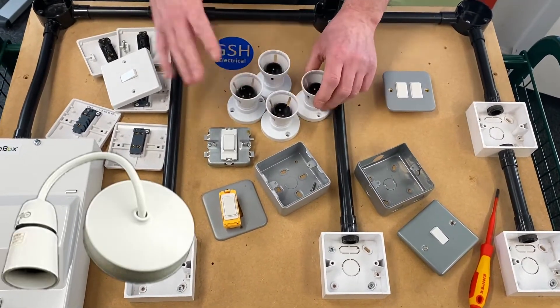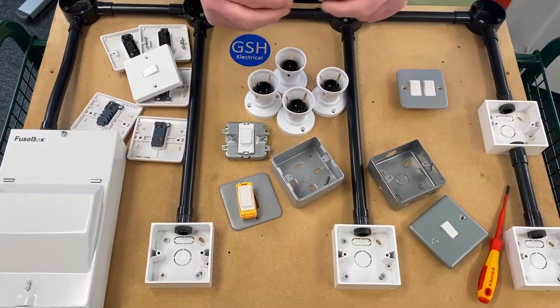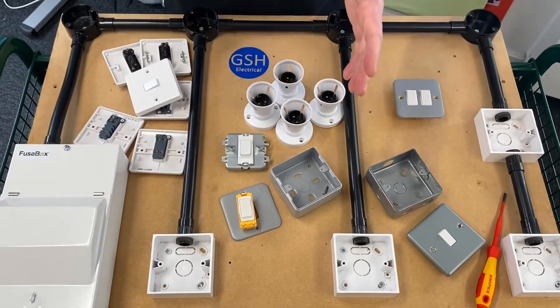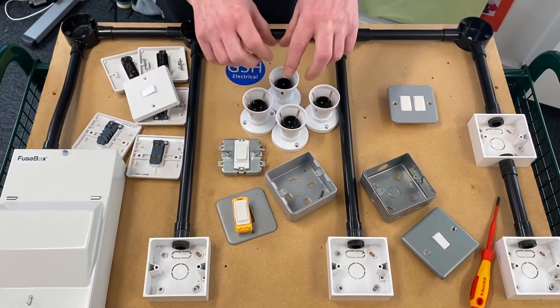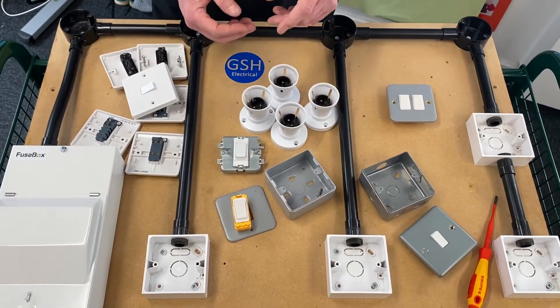You might find that colleges don't use this style of straight skirted batten lamp holder, which loops in the back and doesn't have that looping section for the three plate. They might use the wiring method but only use the terminals we're talking about: the neutral, the switching line, and the circuit protective conductor. So just be aware — you might find you either buy different batten lamp holders or ceiling rose and pendants, or your college does.